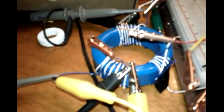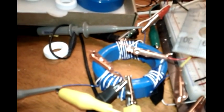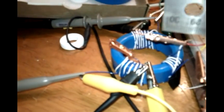Wound another coil. Started with the original approximate length of wire. That one was pretty good. Added a second one that has a shorter half, which goes to the base. So that's the control wire. It also works differently and better if the short is connected to the collector. Then I have some other coils that could either be Joule Thief drivers or are pickup coils. I upgraded to a 2N2222, which gives me a much sharper pulse. This is a 122 ohm resistor. 4.7K just really kills the sharpness of the signal.